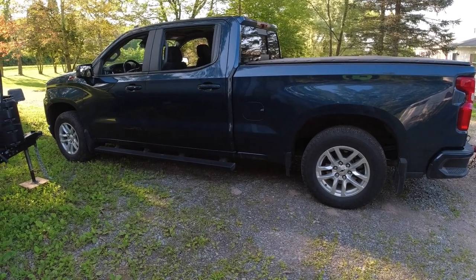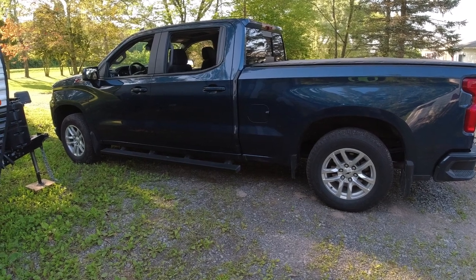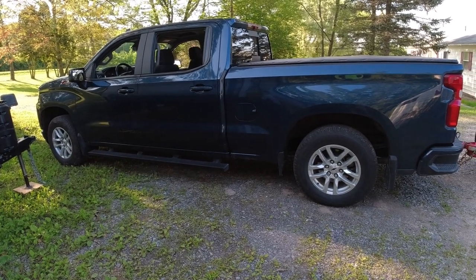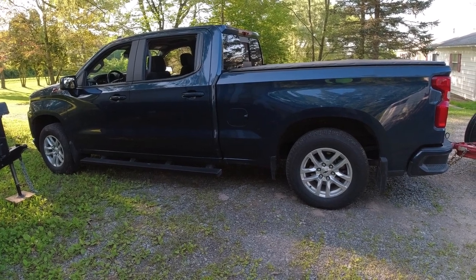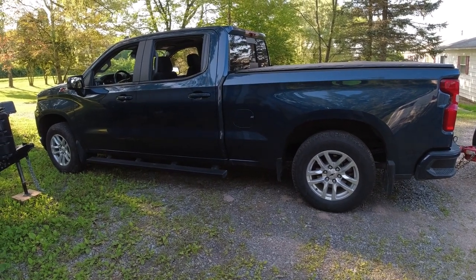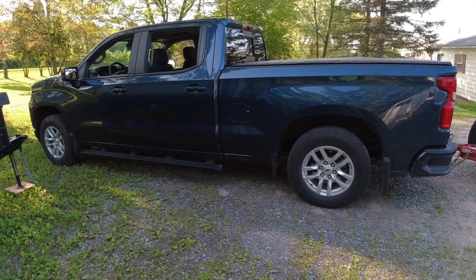In regards to the truck, you also want to make sure you have a brake controller — either one that's integrated into the truck like mine is, or you can buy an aftermarket trailer brake controller. Yes this is a full-size truck, but when you have double the weight going down the road you need double the brakes to safely be able to stop in an emergency.